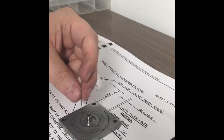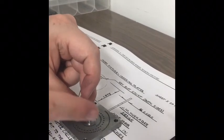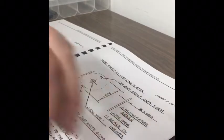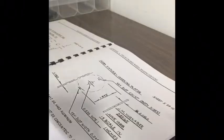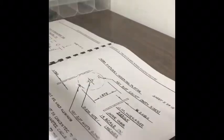I'm going to make a bushing to sit the blank plates in here and lay it down flat. I'll have a hole drilled in the blank with an index pin, and I'm just going to mill a slot, index it to the next one, mill another slot, index it, mill another slot, and so on until I get the number of spacings I need. Once it's all assembled, there ends up being a little pin - this piece here - that engages in those slots.